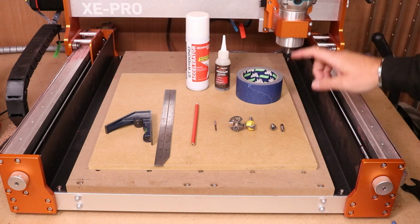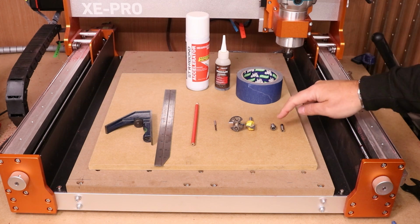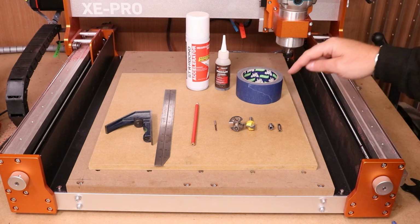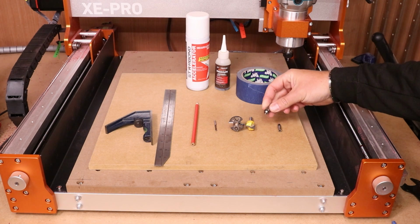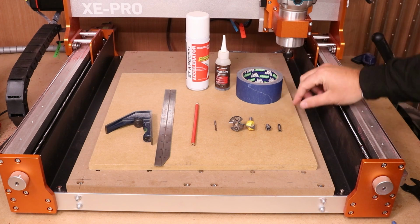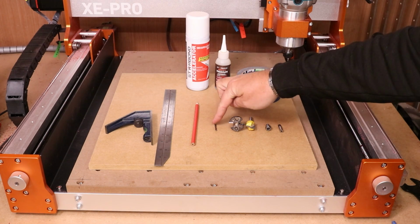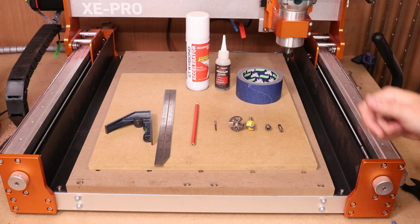Now, depending on whether you are using the router or the 400 watt spindle that came with the machine, you may need a different size collet to insert into them. If you're using the 400 watt spindle, you will need a ER11 1/4 inch collet to go in there to take these bits. If it's the other way around and you are using the router, you will need a 1/4 inch to 1/8 bit insert in order to take the 1/8 end mill over here. I'll put links to all these parts down in the description area so you can access them.